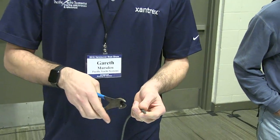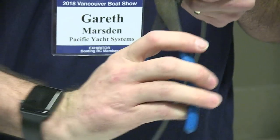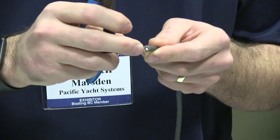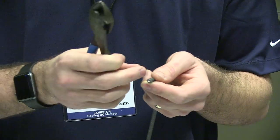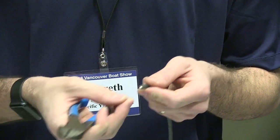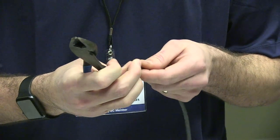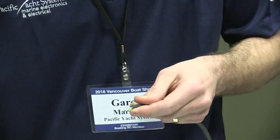And when you're doing this, some people may use side cutters and go like that, but then you end up damaging right around that base where you've cut, and the strands, if you happen to catch them, can snap off really easy. It can create a hot point. In solar, it's not so bad, but in any crimping situation, try to use a knife and keep away from the cores.